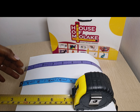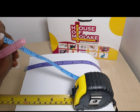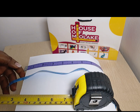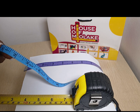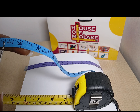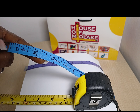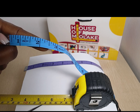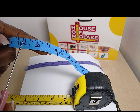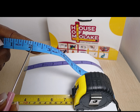You would observe that this measuring tape is quite different from this and from this. And what makes it different is that an inch of this measuring tape is divided into 8 equal parts. That is, from the 1 inch mark you have 1, 2, 3, 4, 5, 6, 7, 8 lines.